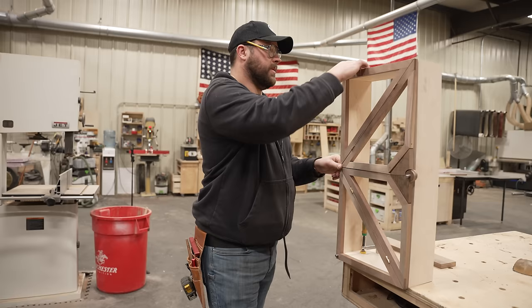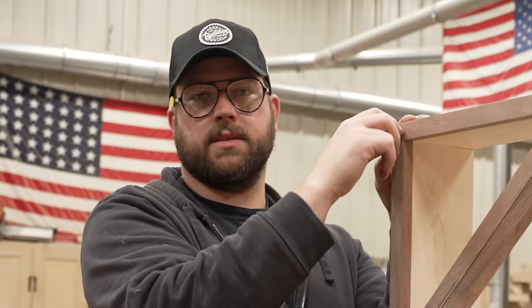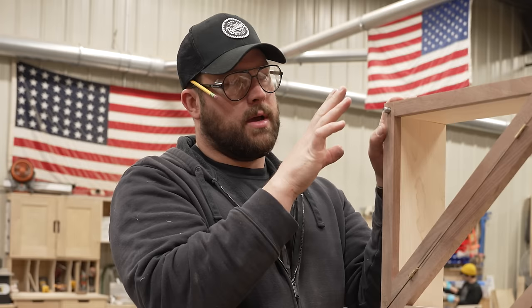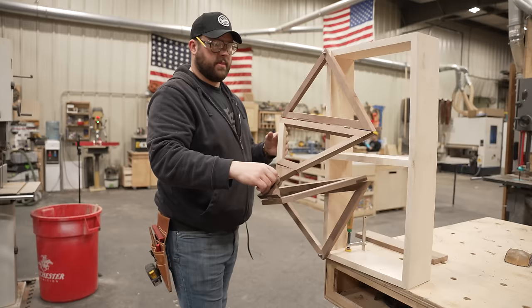But two, I have to take the play out of this horizontal plane in order to get this stuff to actually function. To do that, I think I was going to put a nut on these. I was going to thread it and then nut it on and have that look decent. But I think there's a better option if I just run to the hardware store. I can get a hex screw for a threaded part here, because when that holds closer to it, it'll eliminate the play that's coming into it in the other planes.